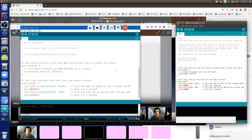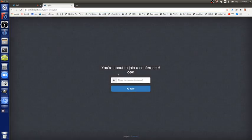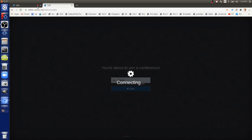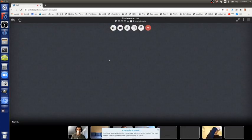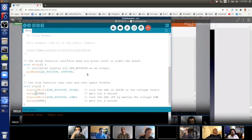There are all these lines of code, but this needs to be converted into a form the microcontroller understands and then sent to the microcontroller. If you have your Arduino board connected to your USB port, it's ready, and you've done those first two setup steps and the drivers, that can happen, and I'll show you that in just a little bit. But only the black, blue, and orange text is real code. The gray and dark gray text is called comments. And comments are only there for you, the human, reading this program, this sketch, as they call it in Arduino, to know what this does.